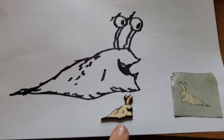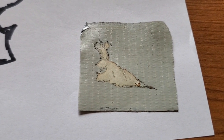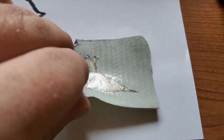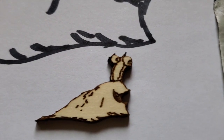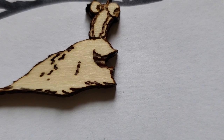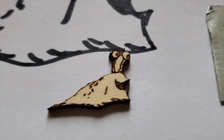There you go - there's the original picture and there's the cutout with the masking removed. You can see the charring's gone. This also shows how the duct tape removes the masking - usually works pretty well. This one wasn't too sticky so it missed a little bit on the eye, but other than that it works well. That's the basics of the trace feature - super straightforward. You can always change the settings; if you turn up the quality you can change the lines per inch for a much higher quality etch. For stuff like my kids just messing around, I usually do draft quality and it still looks pretty good.